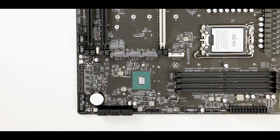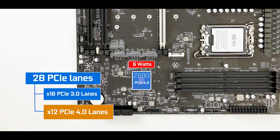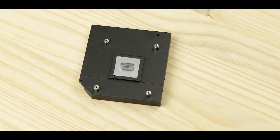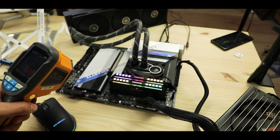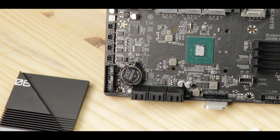Chipset-wise, and this is mostly why we are here, we have Intel's first PCIe 4.0 natively supported chipset. It has more bandwidth, more lanes, and more USB than its predecessor. Most noticeably, the Z690 chipset manages to deliver PCIe 4.0 standard bandwidth levels on a very cool 6-watt heat footprint — all of what AMD failed to deliver with the X570 and its sometimes noisy chipset fans. The Z690 heat shield is much smaller, costs less, and keeps the chipset below 45 degrees Celsius at all times, which is where you want it for a long board lifespan. In short, the Z690 chipset finally brings PCIe 4.0 to maturity and makes it much more usable in today's computing market.